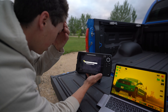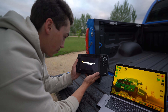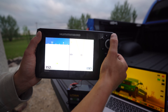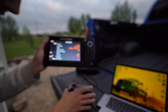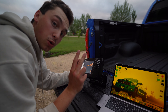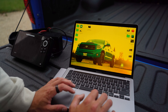Next thing we're going to do — because it's a micro — have an adapter, and we're going to plug this into the computer. If you want to check to see if your encryption works, wait for it to load up. We can see it says 'No Name' and we have an encryption file right there. It is encrypted successfully. Once you have your SD card successfully encrypted, we're going to go to Humminbird's website and get the proper download.